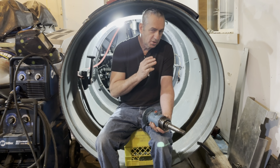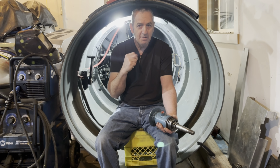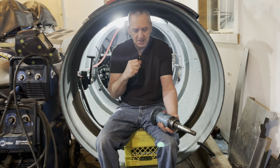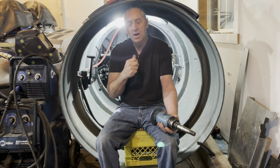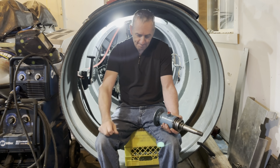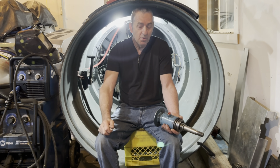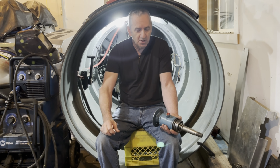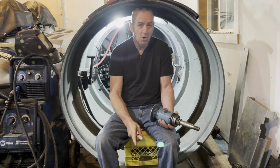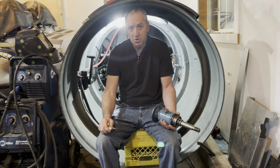So I'm going to try to turn that at 400 RPM. The pump I have will give me the oil flow. Actually, it's running the pump below capacity for flow, but on capacity for pressure. So it's a good starting point. You know, I'll put it in the water. The pump is really cheap. They're dirt cheap. The motors are expensive. So I'd like to use this motor and just put the pump in according to what the motor needs.